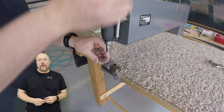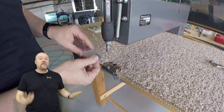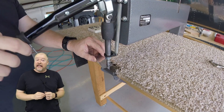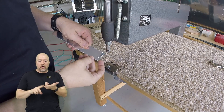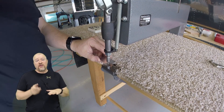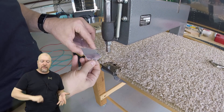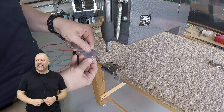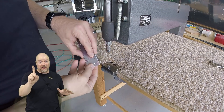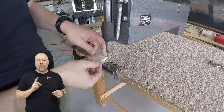What I did is I went through and decided to try dimpling a skin and then flip it over, dimple it the other way, and flip it over — dimple the other way a number of times to see how many times you could do that before you started to have some kind of failure. It wasn't very many. Dimpling one way and then flipping it over and dimpling the other way — I wouldn't do any more than that, because after that you started to get oil canning real bad and then splitting. So if you dimple your skin one way, you can flip it over and dimple the other way once. After that, I wouldn't do it.